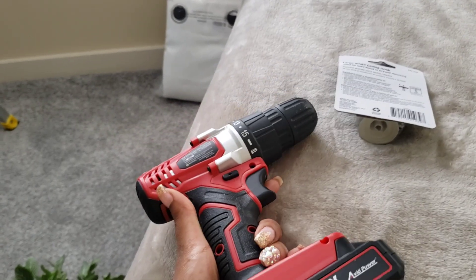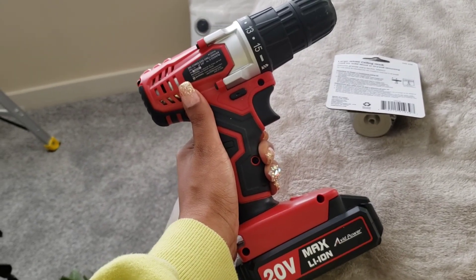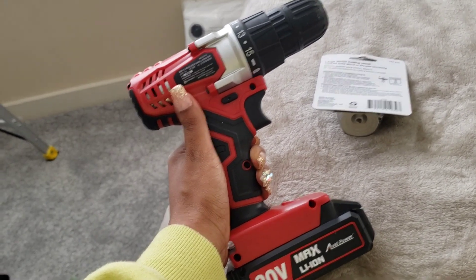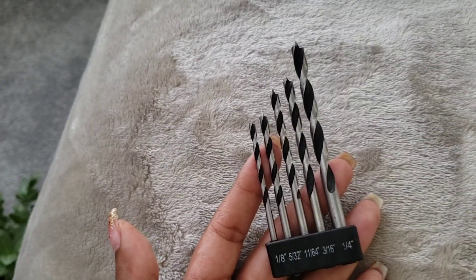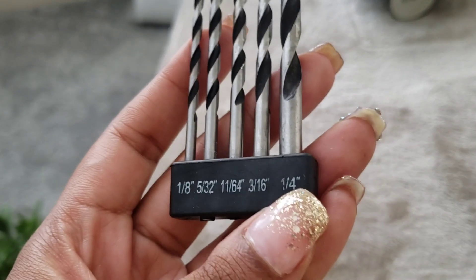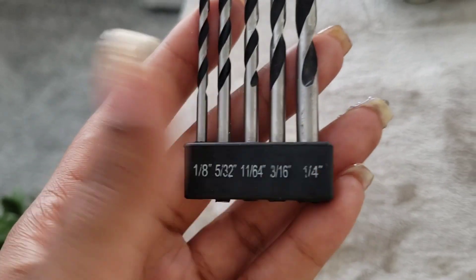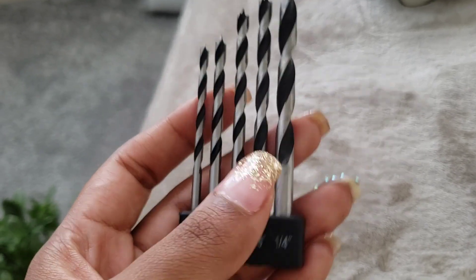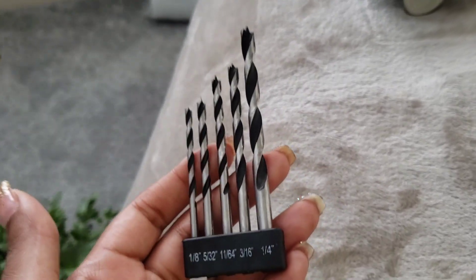For this method you do need a drill. I have my drill here and the instructions say to drill a hole 9/16 of an inch wide into the ceiling. So I'm gonna find the bit that's 9/16, and if I don't have one I'm just gonna make it work. It turns out I do not have one that's 9/16, but that's okay. I'm gonna use a quarter-inch one and do it again until I get what feels like 9/16, which is a little over half an inch — about twice the diameter of this one. So let's do this.